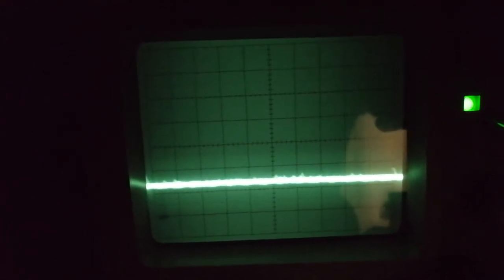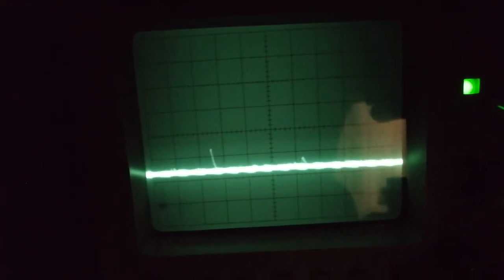Thermionic emission is a big problem, especially when you're applying such high voltages to so few dynodes, and also maybe residual gas in there too. So I'm gonna have to build some system to discriminate between these pulses and the ones due to scintillations of some material I attach to the face of these tubes. But it's just pretty interesting to see the effect of individual particles just easily measurable on the scope screen.